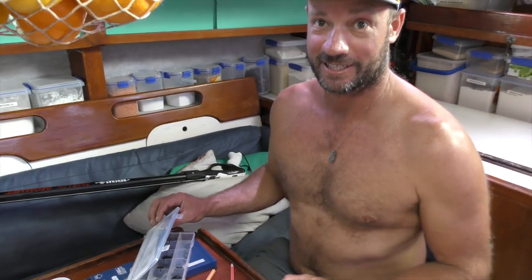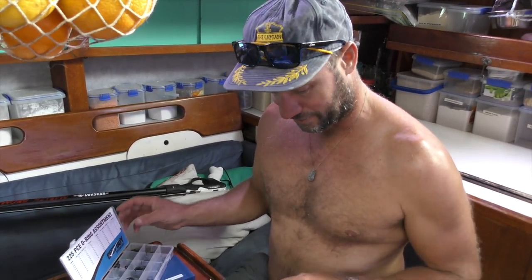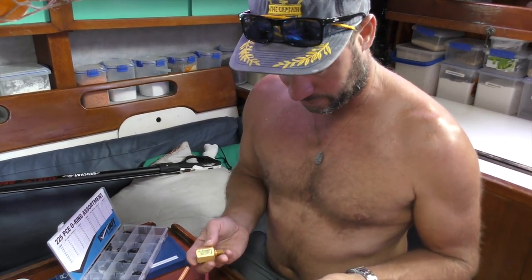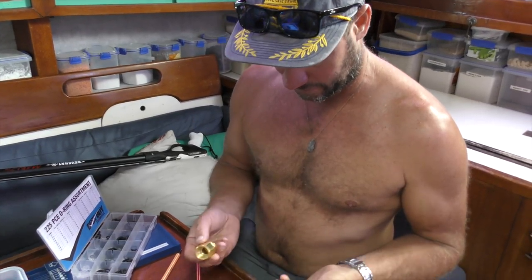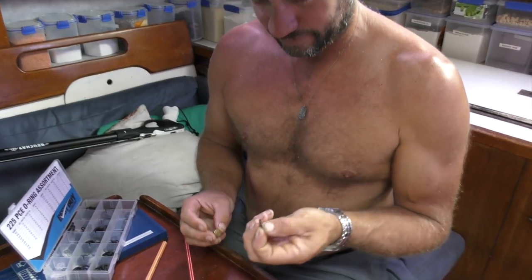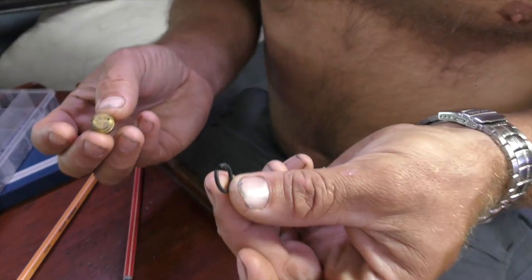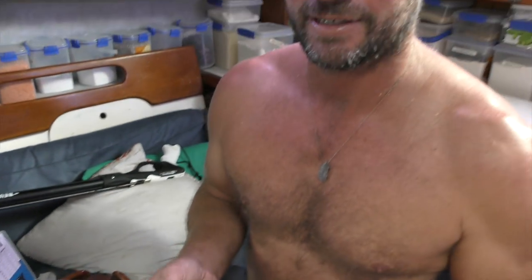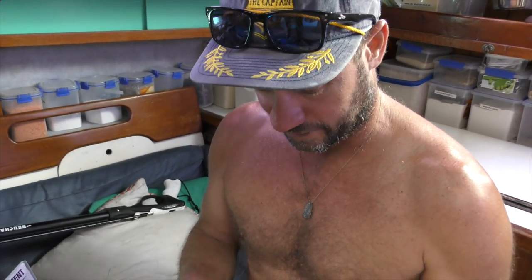Lee's boat tip for today: have a good assortment of O-rings. Today I've just come across a pressure relief valve on the dive unit that was failing. I pulled it apart, very simple little unit, but here we have it, perished O-rings. Probably 2 days ago we had another drip under the sink, again perished O-rings, and they're not that old. It's just a good handy little kit to have because so much stuff has O-rings in it, and it gets you out of trouble.